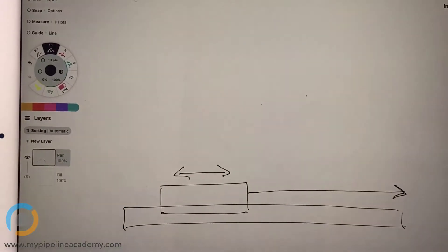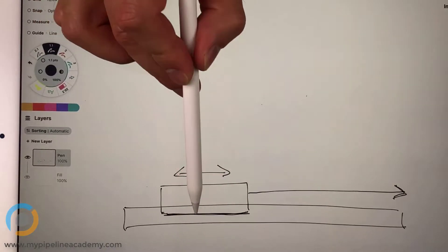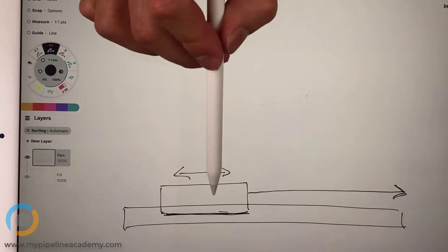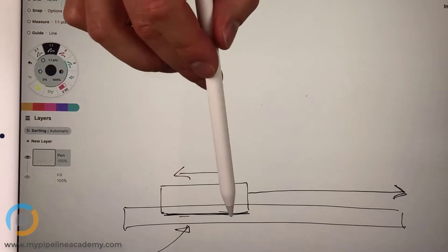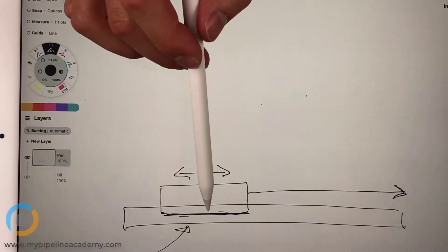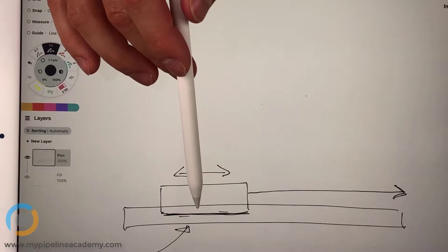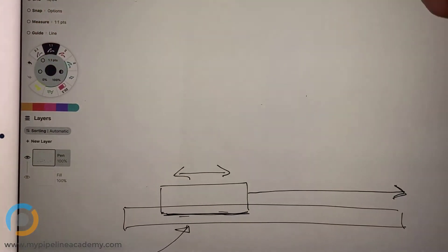What I would do is focus on this surface right here — try to put something on that surface so that it causes a little more friction to reduce the speed at which it moves. But I'm thinking, how can I insert a rotary damper there? Is it even possible? Because the rail and carriage already comes pre-assembled, so we have to alter a part that's already been proven, basically off the shelf. So I don't know how.